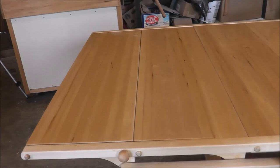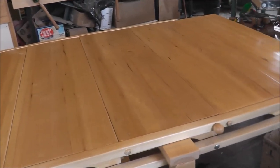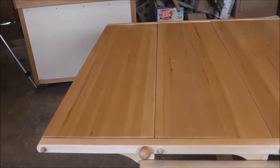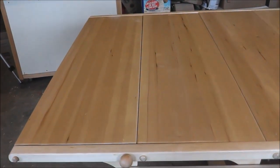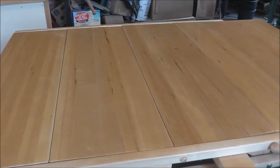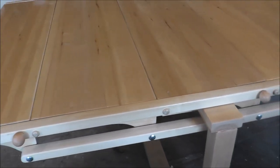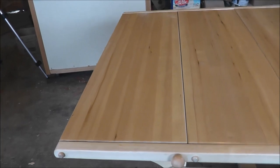To build one of these, the first thing you do is get the boards for the tabletop — you need five boards. These here are laminated out of hemlock; plywood would work well too as it's very stable and doesn't shrink. When I made this the first time, my boards weren't dry enough — I was anxious to get started. I took the unit into the house for a month so the wood could stabilize, but the wood shrank and I ended up with a crack, so I had to make another set of rails.